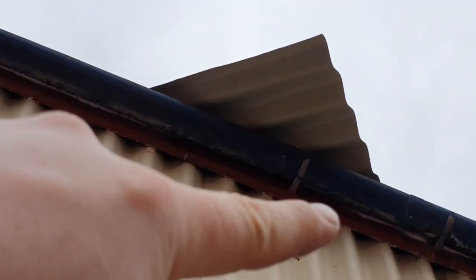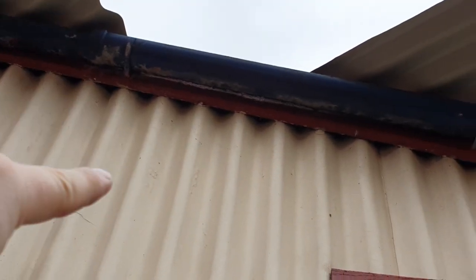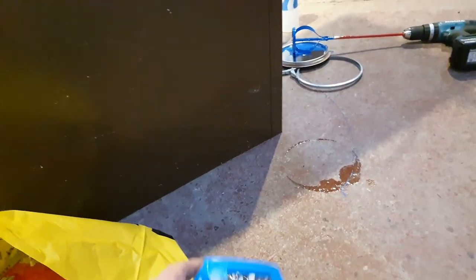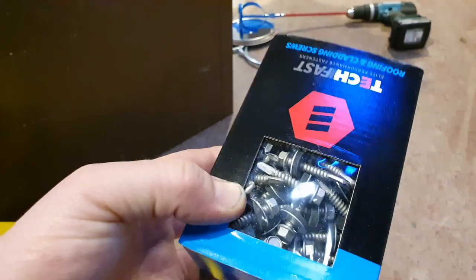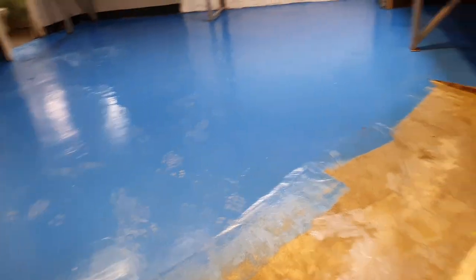I just need to get those ridges on and tidy up the ends - cut the triangular sections out. These triangular sections here need cutting off at the ridge at the edge of the roof, then turned around and used to infill the little sections of triangle that would be missing on the roof - the biggest one being at the bottom. Hopefully we'll have enough off-cuts to complete the job. We didn't have enough screws, so I nipped into Tool Station this morning to get some for stitching the ridge capping to the roof sheets - the ridge capping would otherwise have nothing to screw into.